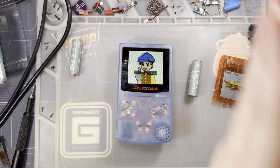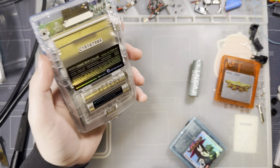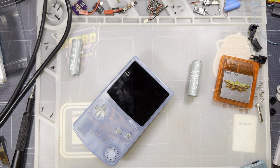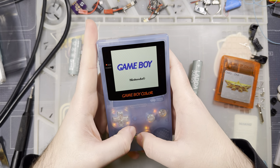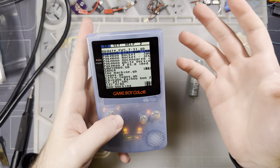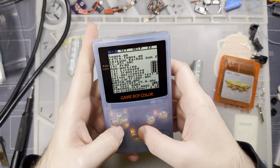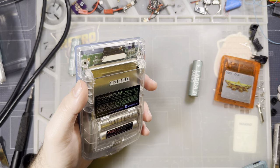Let me explain what's happening. Original Game Boy consoles didn't support transparency in any way. Developers worked around this by flickering sprites on and off as quickly as possible — the terrible pixel response times of the original screens resulted in a nice transparency effect. The cart I'm using here is my test ROM on an EZ Flash cartridge.